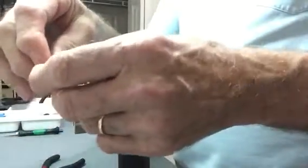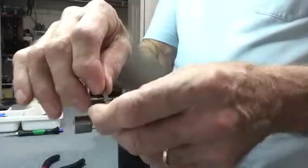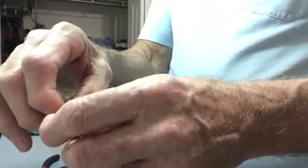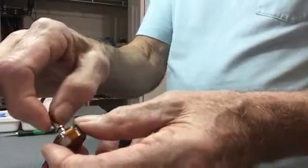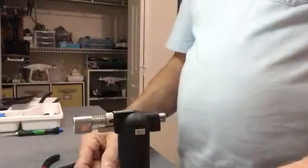Once you've done that, you can put the magnet back down after it's cooled. If the gimbal is off-center to the left or right, adjust accordingly. If it's off to the left, I turn the mark on the magnet to the left side — same direction as it turned. If it only went a little bit to the left, I usually start by placing the mark at the edge of the flat spot, then reassemble everything and check where it centers.